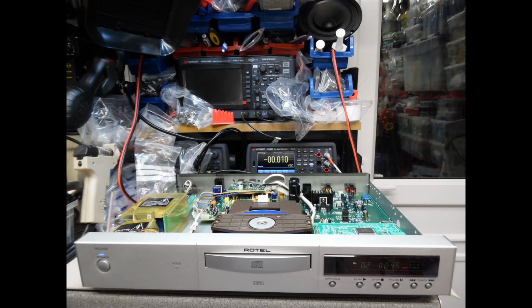What I will point out as well, there is a Japanese company called Futaba, and they are probably the number one manufacturer of these fluorescent displays. For people who own any type of device of this era which uses these types of displays, you'll actually find that over time the display segments become dim. And the reason for that is you just get oxidization which forms, which reduces the overall brightness.